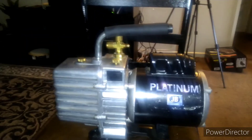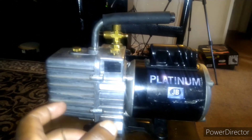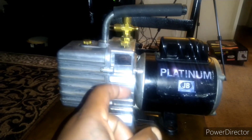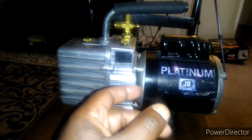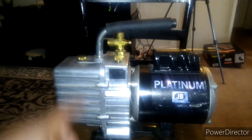I took the motor off and looked at the yellow coupler — it's not brittle, it's not broke. The shaft had stayed engaged, spun a little bit, stayed engaged. But I took the set screw off using the allen key, pushed it down the shaft, and tightened it up.